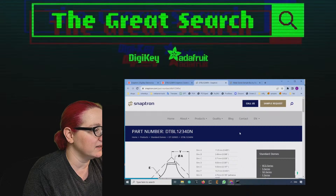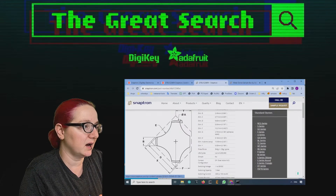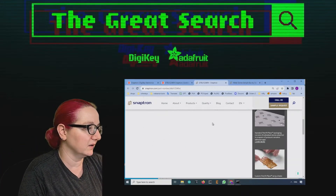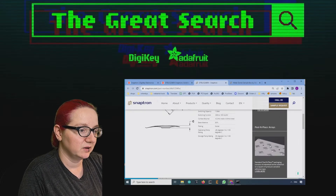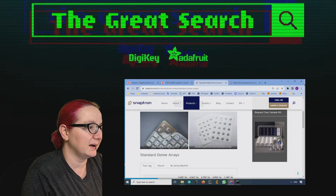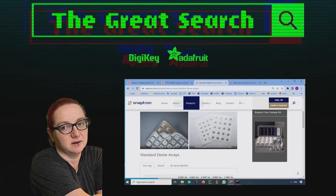One of the series I thought was very neat was particularly the dual tactile dome S switch. What's neat about this is there are two contacts — you solder in three pads and one is left floating. When you first press, this contact touches first, and then when you press in even more, the center contact goes in. There's also the peel-and-place detail — ready-to-go sheets that you just press on. Instead of picking and placing dozens of switches, you just tape it on using a jig and all your buttons are placed instantaneously, using mechanical contact instead of soldering — although you can solder these as well.